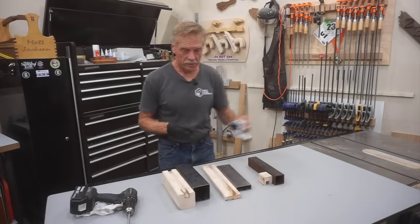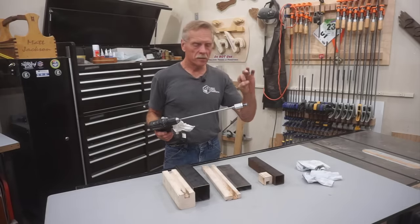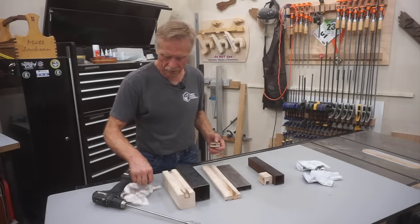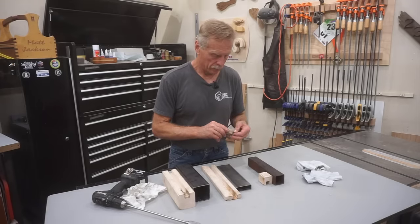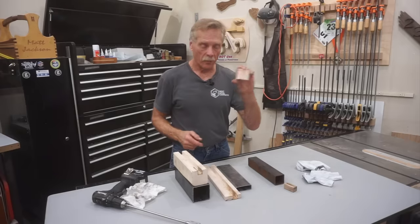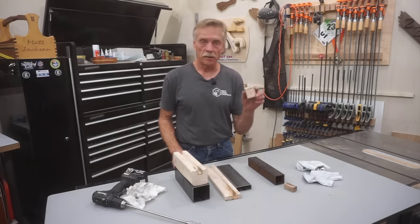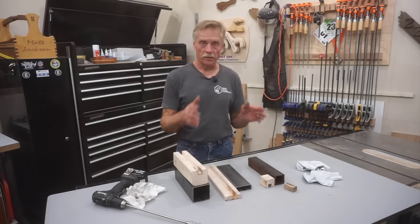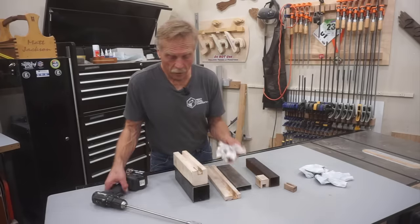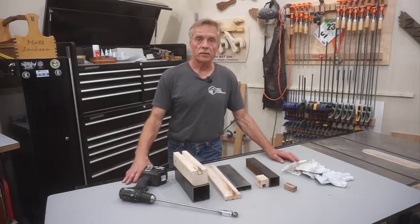I am completely satisfied with the performance of the Seams Impossible 2 tool. Having the bearings firmly set in a piece of metal rather than bouncing around a little bit in a block of maple is definitely worth the extra effort. I really like having a jacket that's the length of the tube and just pulling the tool through the jacket saves the messing around with pilot holes, though for repetitive work the movable jacket is a good idea. With all that done, you get a pretty good idea of what the Seams Impossible is capable of and the features of the Seams Impossible 2.